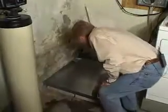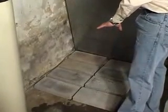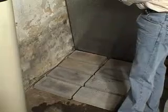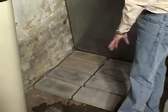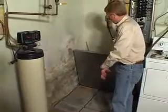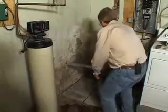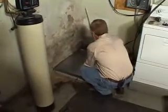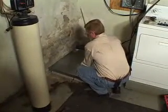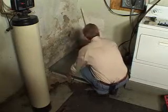What we're doing is laying a base for the new tank. We laid down some patio blocks underneath so that we've elevated the pan from the floor a little bit and created some airways between the blocks so that air will circulate underneath the pan to extend its life. We're going to lay the pan down on top of that and then put the well manager tank in the pan.